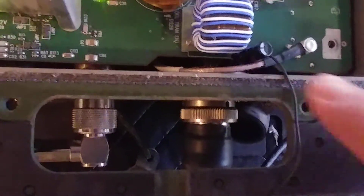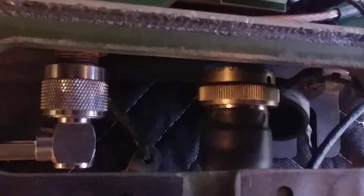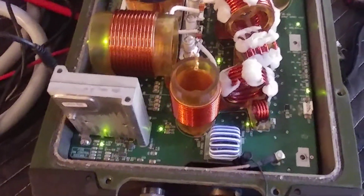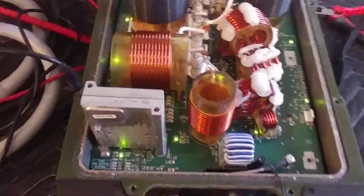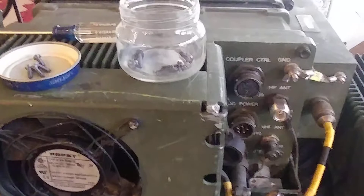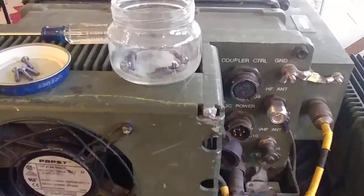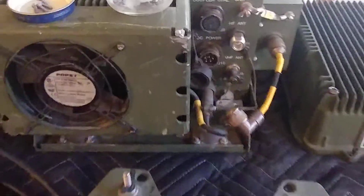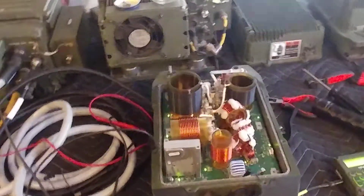Next I have to figure out exactly how to permanently ground pin B. I won't be able to do it in the cable — there's just not enough room in that 19-conductor cable, which is already about the size of my finger. I'm hesitant to do it in the coupler even though it's open. I think the right place is in the amp itself, since its documentation says no connection on pin B, so I won't really be affecting anything. I'll try opening the back of the amp and grounding pin B there.